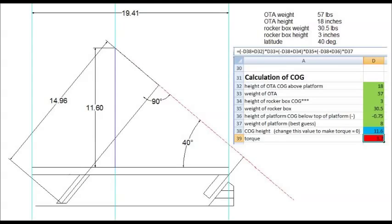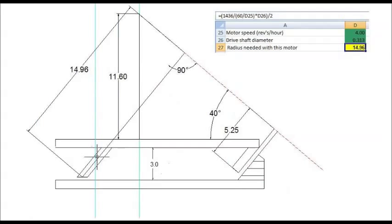Using CAD, I draw two light blue lines coming down from the front and back of the platform, and then a light blue construction line coming down from the center of our triangle, which is where we draw our center of gravity at 11.6 inches high. Then we draw a virtual polar axis. Next I draw a construction line coming down from the front of the triangle where our feet are, and then a perpendicular line from our polar axis, so that we're going to construct the north bearing around the area of the little cross there where the cursor is.